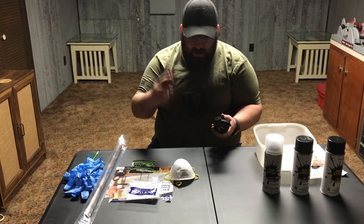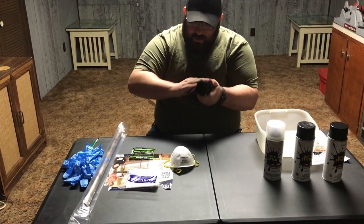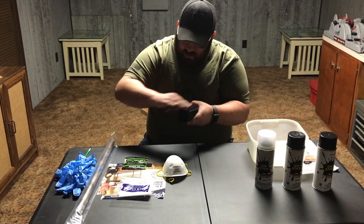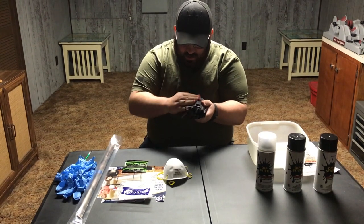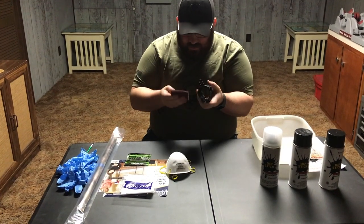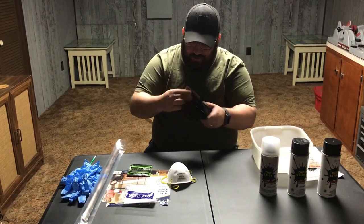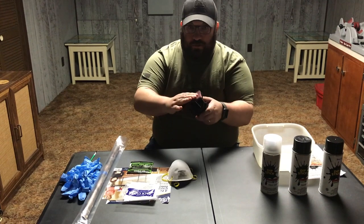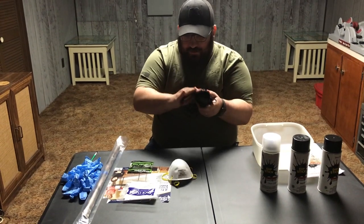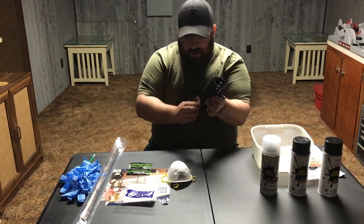So step one, go to town with the scuff pad. Make sure we scuff up the entire surface to be painted. I wish I could give you an exact science to this, but I can't. The real truth is we just need to abrade the entire surface that we're dipping. We need to remove all oils, we need to remove all grease, etc. Obviously, when we clean guns and accessories for guns, there's oils and all kinds of stuff everywhere. We need to go down to bare metal here.